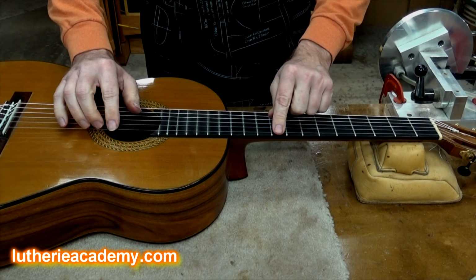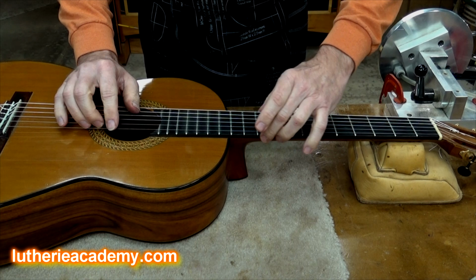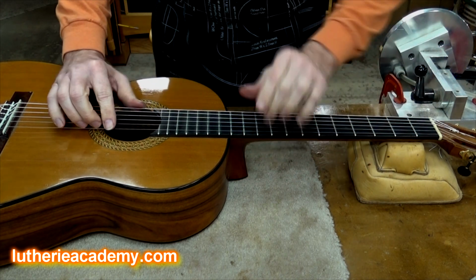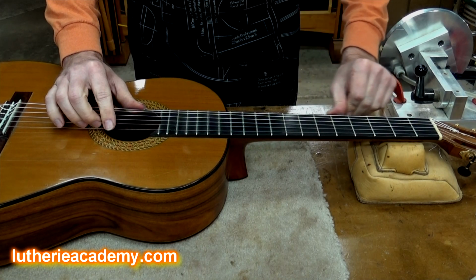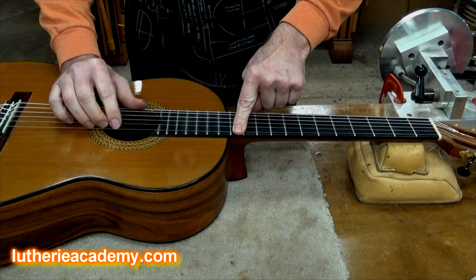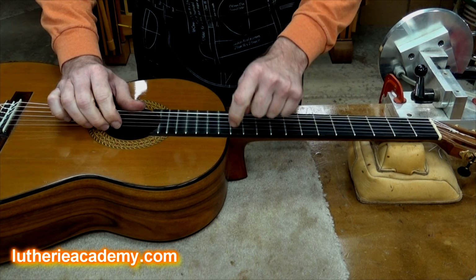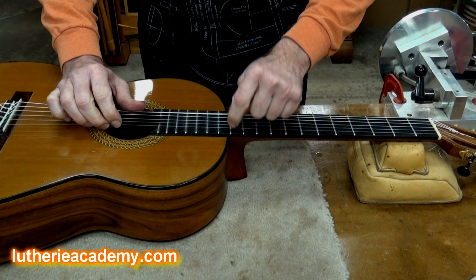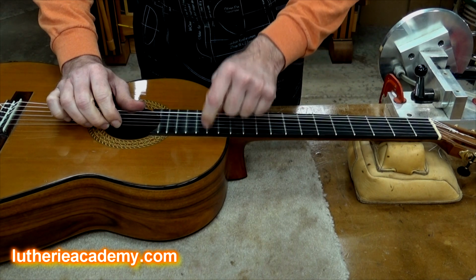If the guitar continues to dry out, the next progression is you're going to notice beside the fretboard, the fret ends are going to start to stick out the side of the fretboard. The fretboard is shrinking, the metal does not shrink, and therefore the fret ends start to stick out, and that becomes quite uncomfortable to play. If it continues to progress further, then you might notice the fret ends are starting to pop up out of the sides of the fretboard, not stick out from the side, but the actual fret itself will start to lift from the fretboard face, and you may have loose frets starting to happen. Then you get buzzing when you play the strings up the fretboard.